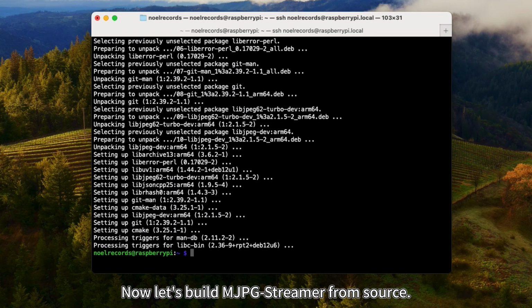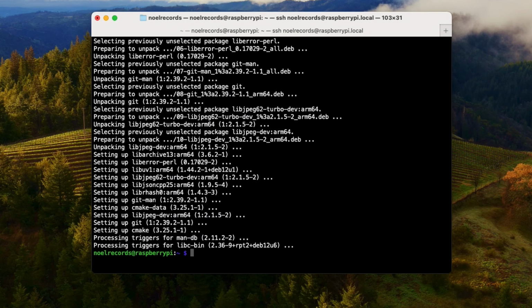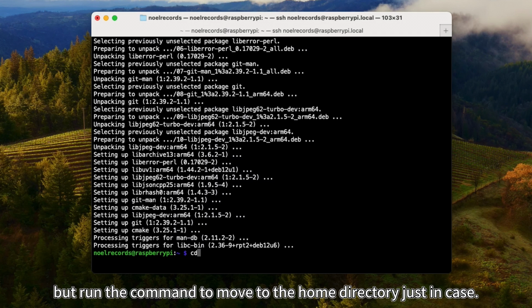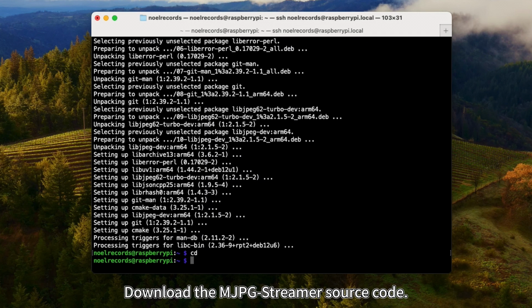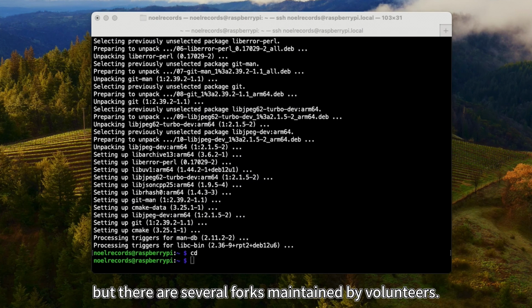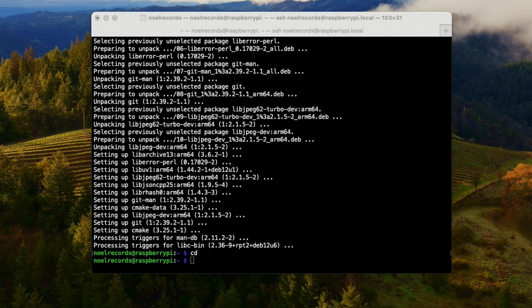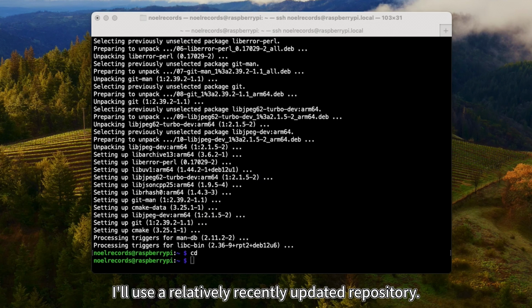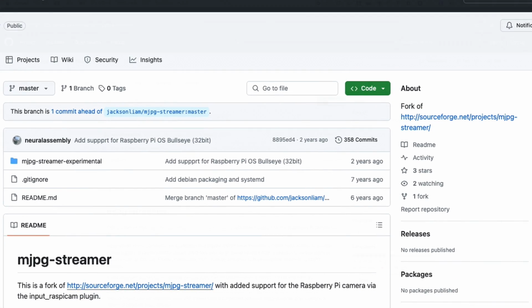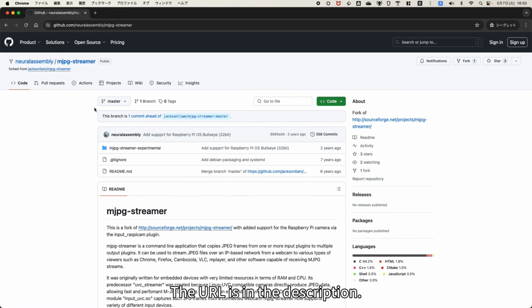Now let's build MJPG-Streamer from source. We'll work in the home directory. If you've followed the video so far, you should be in the home directory. But run the command to move to the home directory just in case. Download the MJPG-Streamer source code. The original project is no longer being developed, but there are several forks maintained by volunteers. I'll use a relatively recently updated repository. The URL is in the description.